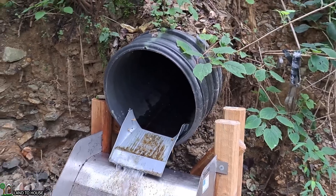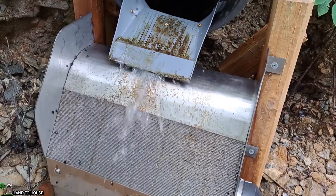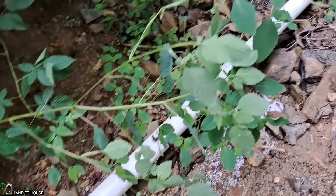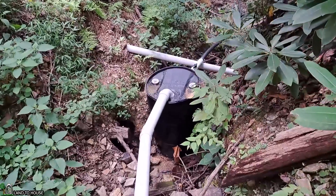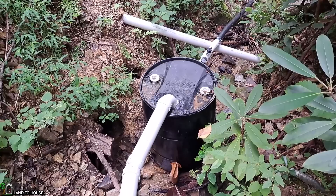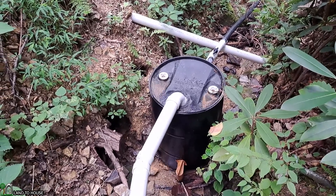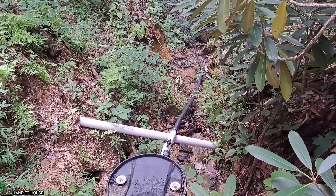The water is flowing in the creek out of this culvert pipe, and they've got this little diverter which pushes the water down into the Coanda screen. This will slough off debris that may get onto this intake from the creek. From here the water goes down this three- or four-inch pipe and goes down to a silt filter and air filter 55-gallon drum. This will separate a little bit of silt towards the bottom but also allows air and overflow to come back up the top. I believe we can turn on one more nozzle since we have this much overflow here at the 55-gallon barrel. From here the water is going to go down the two-inch penstock down to the PMA.